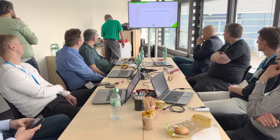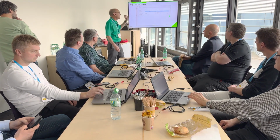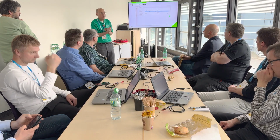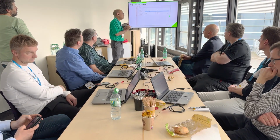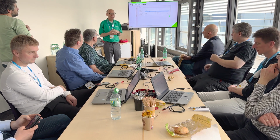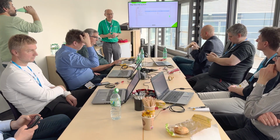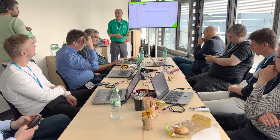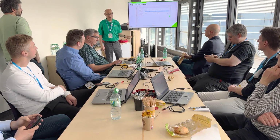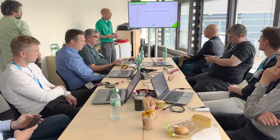Last item on the list that I wanted to show is the file system. So you can also store files. This is important for MicroPython files, but you can also store modules or libraries that are needed. You can write your own files to the file system. I use that in our GPS demo. I write the latitude and longitude once I picked it up so that it can be reproduced in case we lose GPS signal. And I just make my own file for that. You can also securely store certificates on the device. Very important if you're connecting something like AWS or you've got your own security certificates.